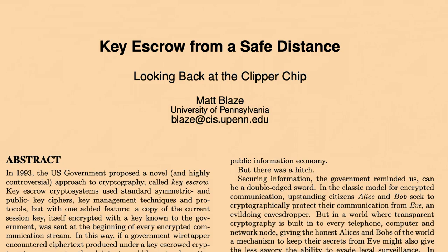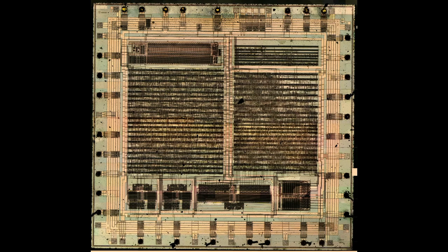He also explained some cryptographic tricks for building a secure cryptographic algorithm out of the backdoored one. Like, you could do your key escrow dance, get a shared secret revealed while talking to each other in the same room, and then reuse that months later when in different countries. Because that's not being resent, it's not part of the key escrow dance. This is a photograph of the MYK78 I took ages ago. Here in the bottom left are two little lookup tables. On the newer Clipper chip — the one in the PCMCIA card I've been reverse engineering — the structure looks slightly different, but all of the bits are the same. This is the F table from the Skipjack cryptographic algorithm, which was classified at the time this chip was first released.